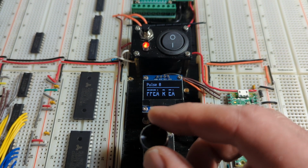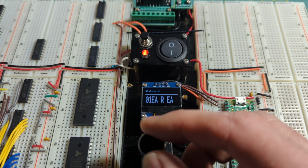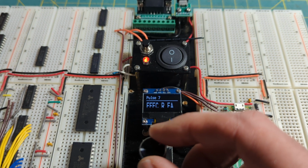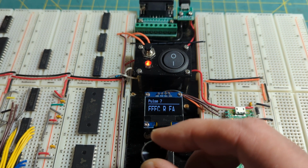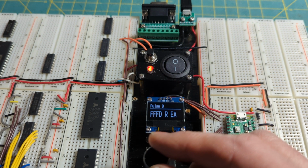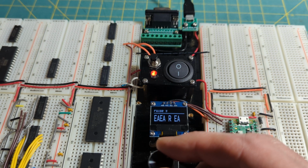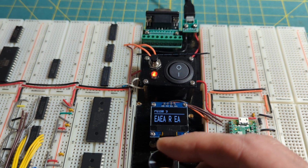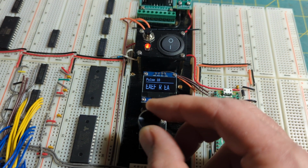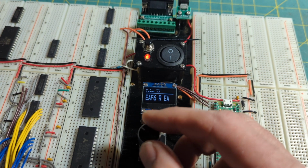this knob, it's going to just single step the clock. So right now the 6502 is going through its initialization, and then here it's reading the reset vector FFFC, FFFD, and both of those came back EA, which is telling it to jump to the memory location EAEA, which it does. And EAEA, when it tries to read from that, it's going to get, of course, EA, which is a NOP. And so then every two, you can see here as I turn. So every other cycle here, it's just advancing to the next location.